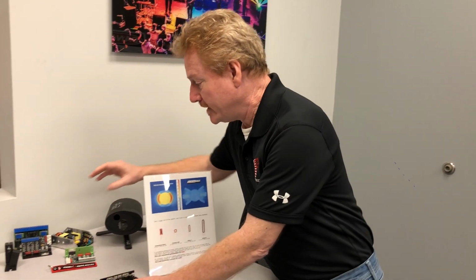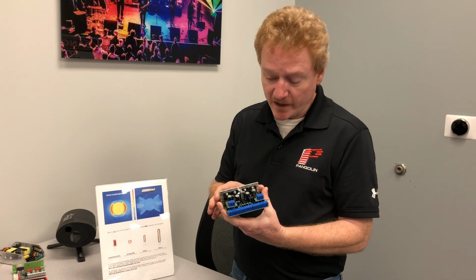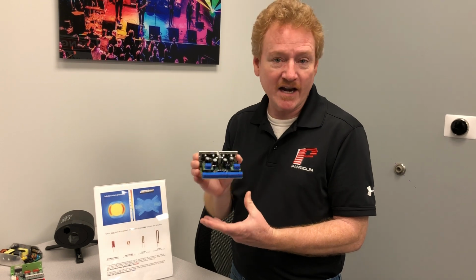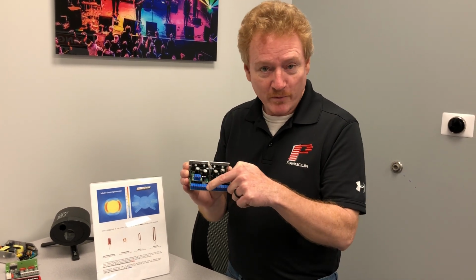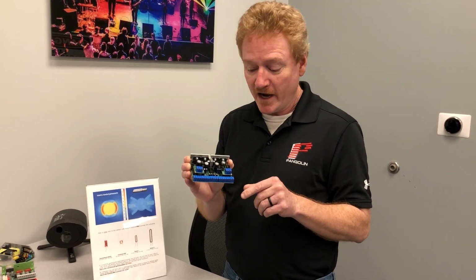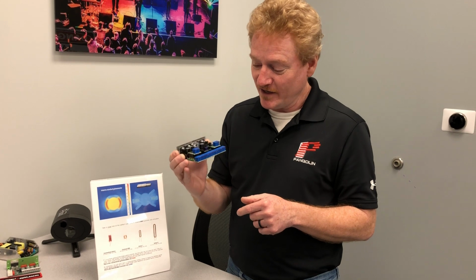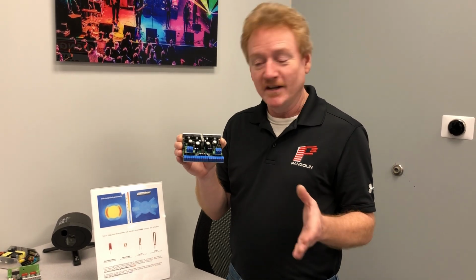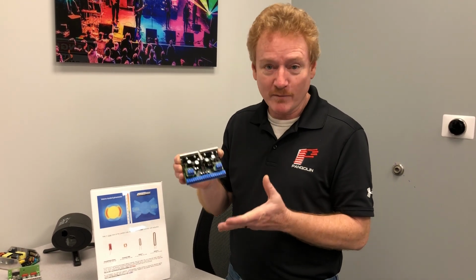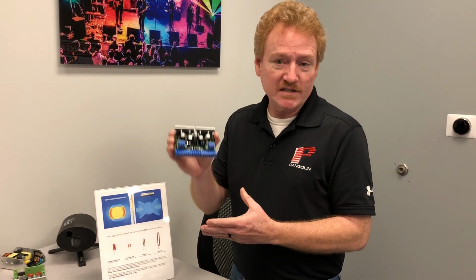So now what's typically done in the world, like this is a more typical servo driver that would be out in the wild and that has served the optical scanning business for the last about 45 years, believe it or not. It's an analog servo driver. You notice that there's a lot of pots on this thing, and to tune this thing, it really takes an expert that has a lot of training, because there are so many different combinations of ways that this thing could be adjusted. Getting it right only happens with a super seasoned professional. So that actually represents a problem for the industry, because there are only so many of these super seasoned professionals out there. But this is an analog servo driver.